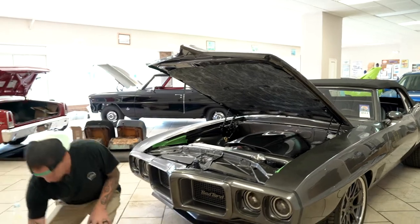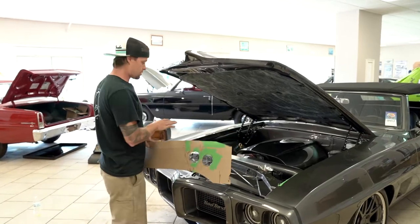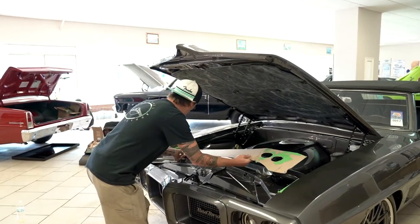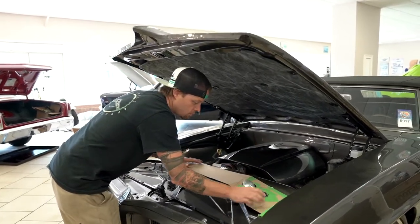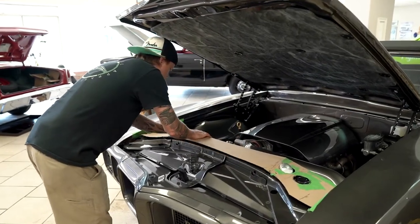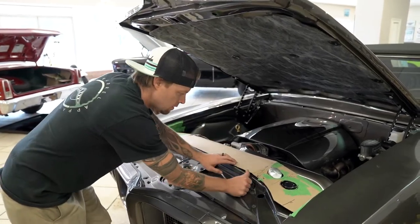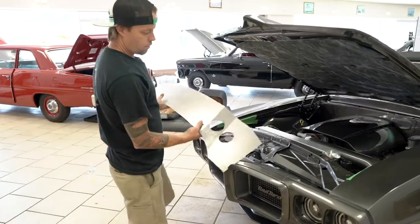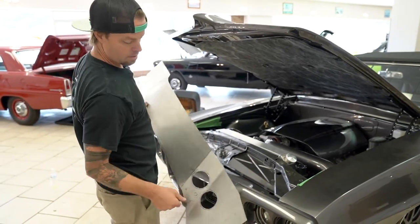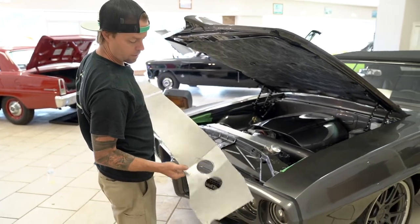Here's what I've done so far. I've got some template board I've been working on, figured out the design. I've measured everything out, got this piece where it bolts in, radiator — all that looks good — cut out for the hose itself. We've got a brake and a roll in it. We basically copied from that cardboard template and snipped it out with hand shears. We've got all our provisions for coolant and that stuff. I've already put the brake in it and put the roll in it.